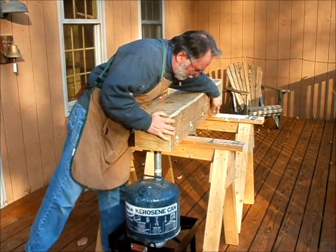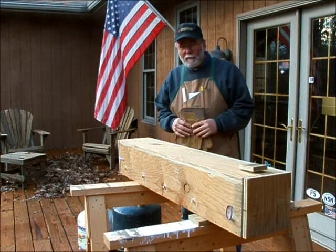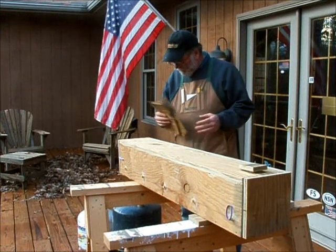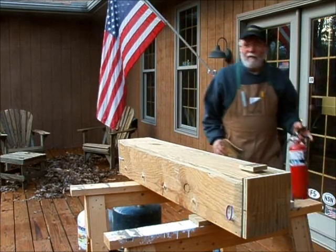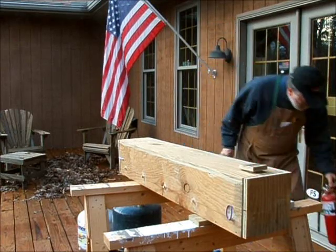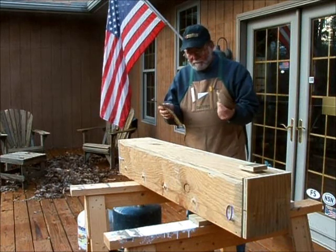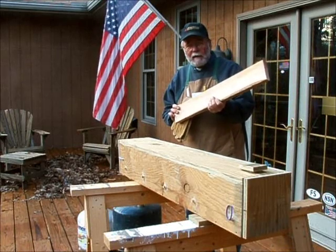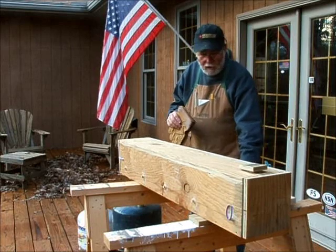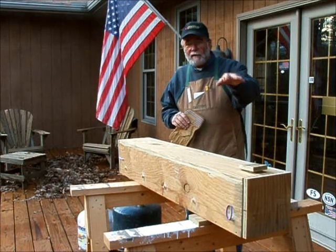The box is raised up a little on the front so condensate will flow back down into the pipe and back into the can to be turned into steam again. There's my burner and my propane — let's get started. I've got a fire extinguisher handy, some heavy gloves for when the steam comes, and a test board that I'll put in there to heat up. I also drilled holes in the top and the side where I can put a thermometer and measure the temperature near the outlet where it would be the coolest.